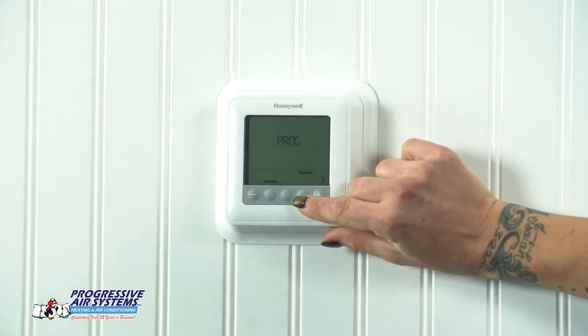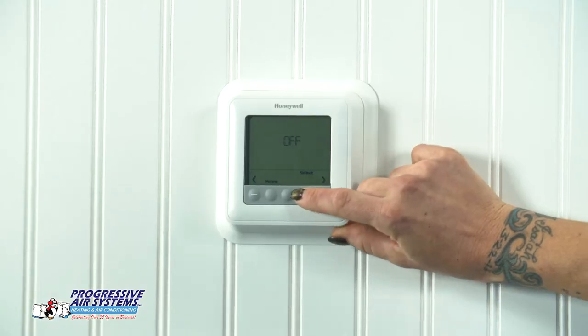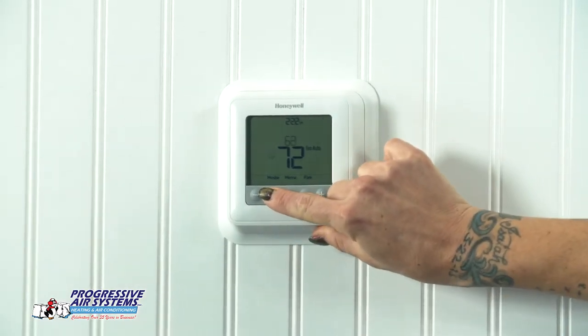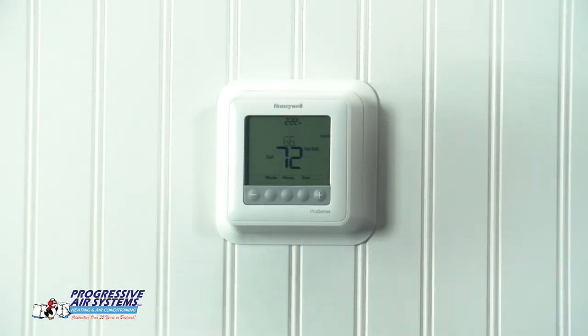This is a basic programmable thermostat. Most of our thermostats are programmable these days. If you do not wish to use that feature, we can turn that off and I'm going to show you how to do that as well. Over here on your thermostat, you've got menu. Push menu and you see programming on the screen. You'll hit select, arrow over until it says off, push select, and it will save and bring you back home. Then you can go ahead and turn your cooling on, change the temperature up and down, and it's going to stay right where you set it.